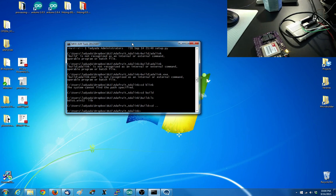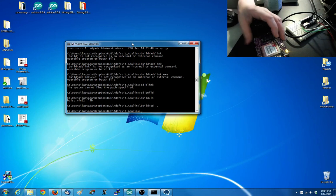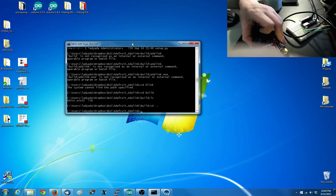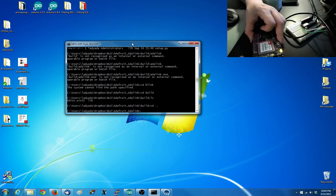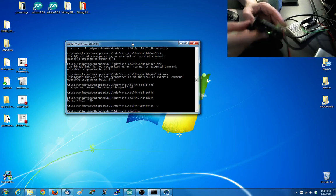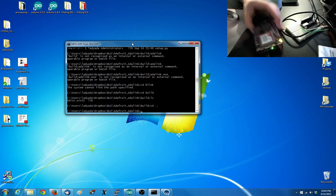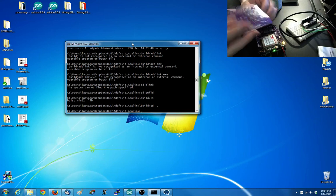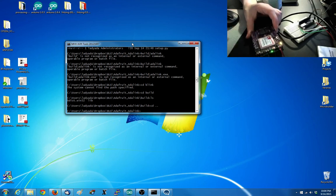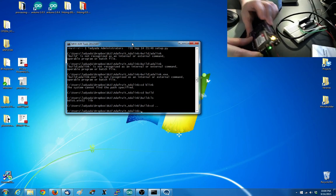Next up, just for fun, I'm going to connect an antenna, even though I'm not putting a SIM card in yet, mostly because I want to make sure everything else is running. Okay, it's looking good. Let me see. The connections are RX, TX, reset, and then key should be tied to ground. I'm not lighting up. Okay, we'll see what's up.